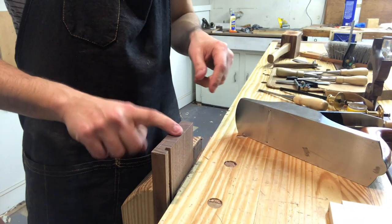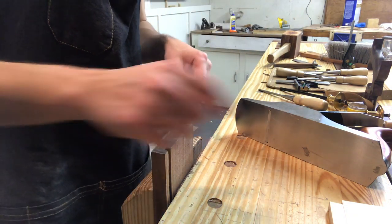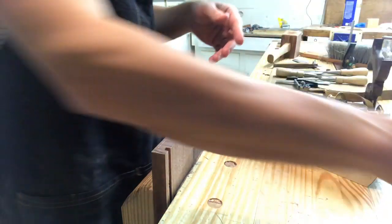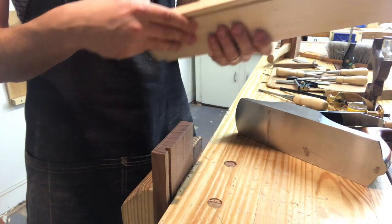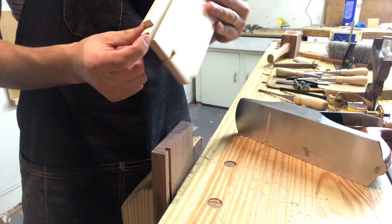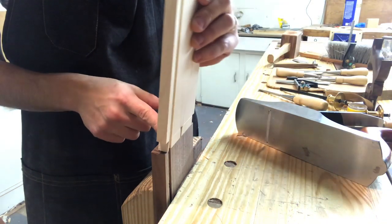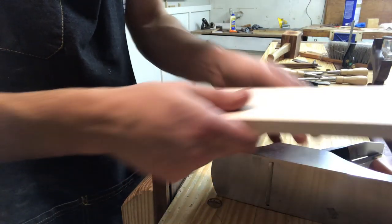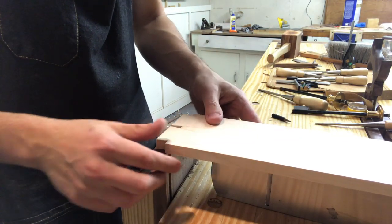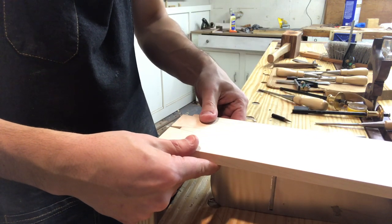So this is my right side of the drawer front here. So I need the right side of the drawer itself. And the easy way to know that you're on the correct one is to make sure your grooves line up. So I have a groove here and a groove here, and they are lining up. You see that? So that means I'm correct. Since the grooves are what really need to be matching here, to make sure we're correct.